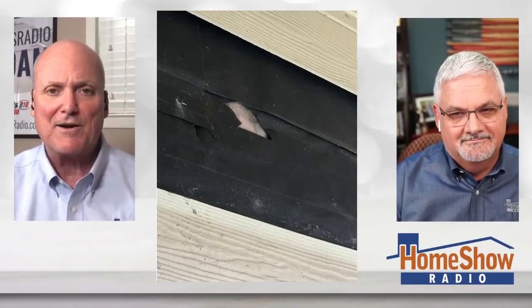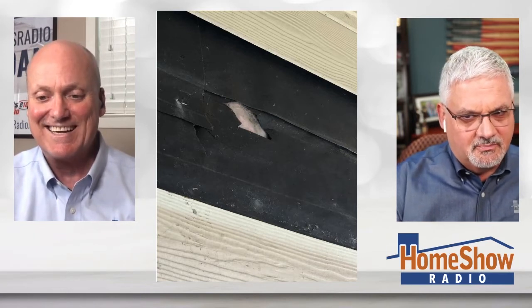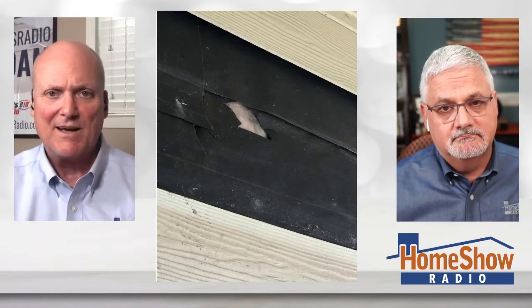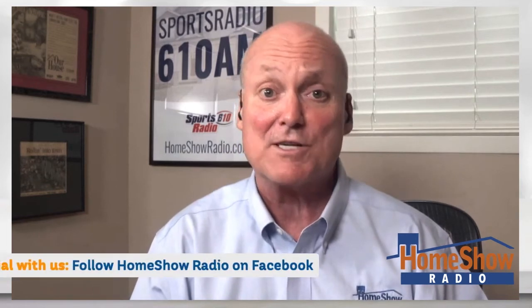I see a little tear on the paper there. If you want to put a little duct tape on there, there's a place it'll go. And go ahead and put your Hardie back. And don't listen to all the people. Is that what you do? You put a little duct tape on it and move on? I put a little piece of tape on there, a little air conditioning tape, duct tape. I wouldn't use packaging tape, but yeah, duct tape will work. And then go ahead and put the Hardie back on there and let it go at that, because it's going to be fine as far as the warranty.